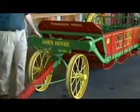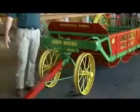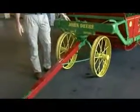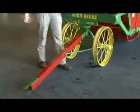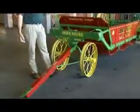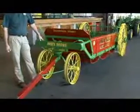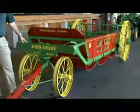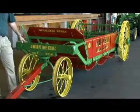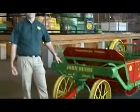This was a horse-drawn spreader, where you had two horses up here. There would have been a seat attached to this bracket that you would have sat on, over your product in the hopper. As you went to the field and wanted to start unloading, you threw your levers ahead, which started the beater system in the back to spread it, and then the wooden conveyor to move the product toward that spreading system for application to the field. And of course, manure was the only way of fertilizing the crops back then. So if you had no livestock, you really couldn't raise much of a crop, because the crops needed additional nutrition to grow.